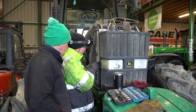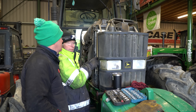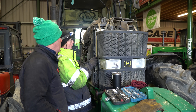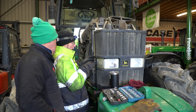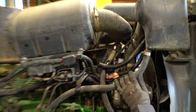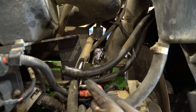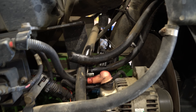The 7810 is in for a small little bit of TLC. There's a fuel cooler out here — the fuel pipe going to it, if the camera comes around there you can see it. It's just fatigue, age — it's all cracked. That was pissing diesel everywhere.